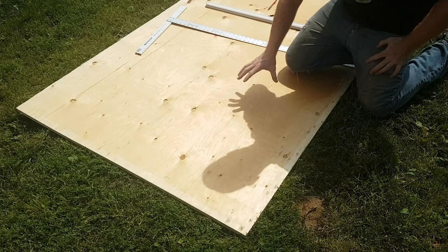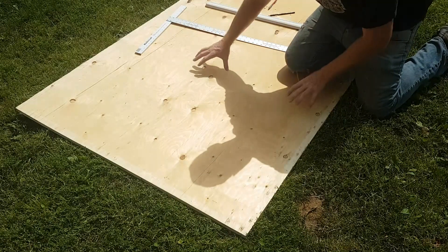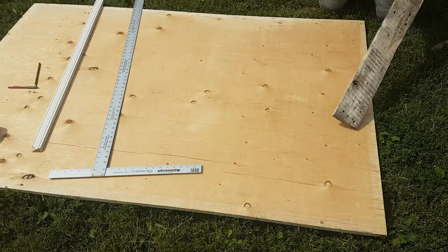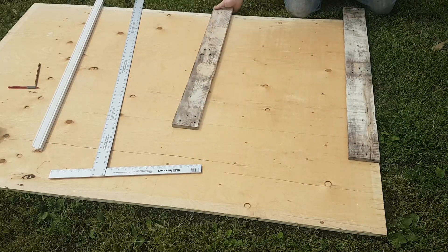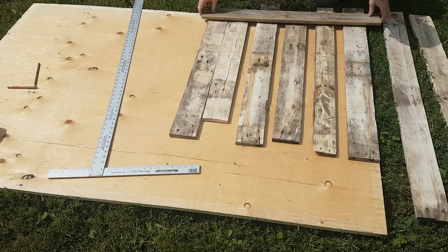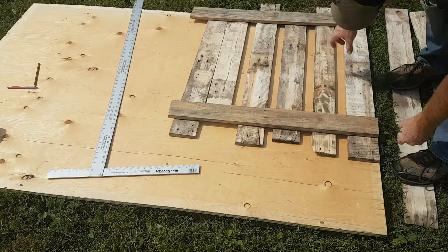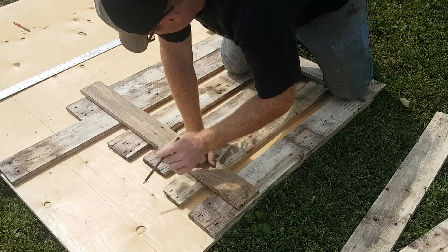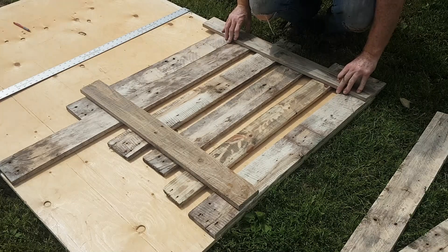Because I know I want my baby gate to be 31 and a quarter by 32, I went and drew a square on the corner of this piece of plywood in pencil. Let's go ahead and do the layout — start off with our two end pieces, then we've got two cross pieces here. With those lines on my boards, let's go ahead to the miter and cut them off.